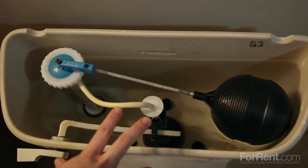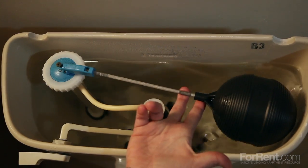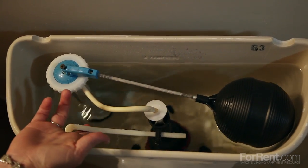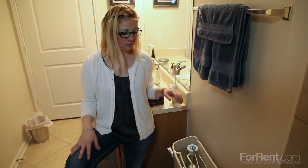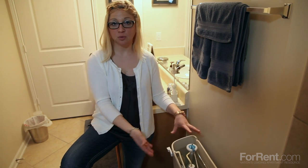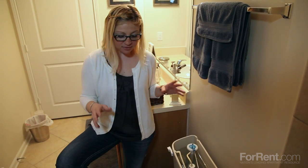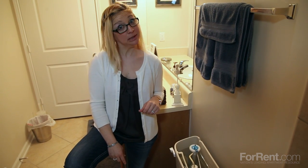So how does a toilet work? Inside the tank there is a float that rises as the water level rises. This float signals the water to turn on for filling and to turn off when full. Pretty basic, right? So the theory goes that placing a weighted item inside of the tank shuts off the water fill prematurely — meaning every time you flush, less water goes into the bowl from the tank, therefore saving you water and money.